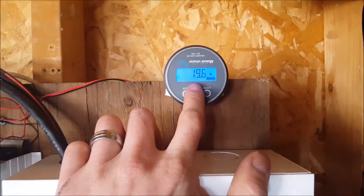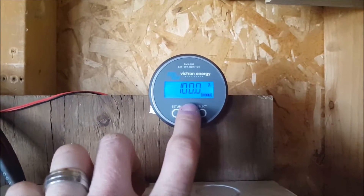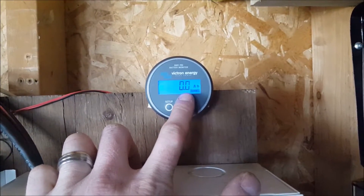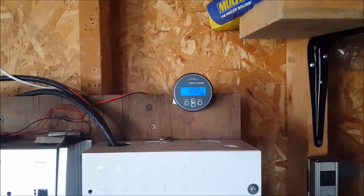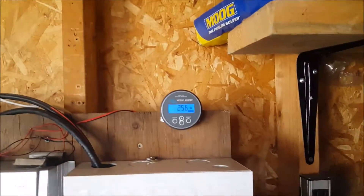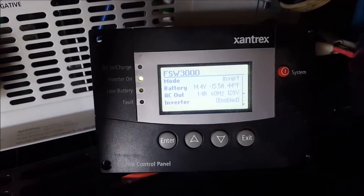It's nice to see exactly what's going on. We've got 20 amps going into the batteries even though the batteries are almost full. Batteries are at about 14 volts — that's pretty good. It says basically infinity for run time right now because we're not pulling too much power and we've got lots of power coming in. 100 percent battery. We've used zero amp hours so far. It's cool to see that go up and down — as something surges in the house, we use amp hours, and when it shuts off we put it back into the battery. We're almost at our float voltage. This one's floating, this one's limiting current, and so is this one now.